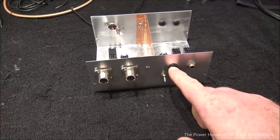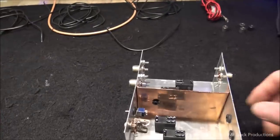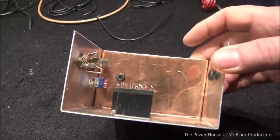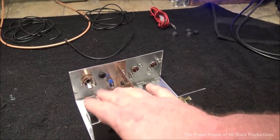On off switch, this is going to be his power wire port, and then of course his trigger source, the one that's going to start the whole chain reaction of things. So three relays to drive the show, and then of course we built this copper shield in there. So when we put the lid on this thing, it's going to be an RF isolated circuit. So I don't have to worry about RF getting into any of the relay